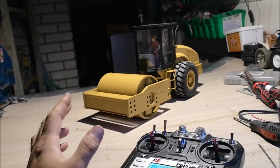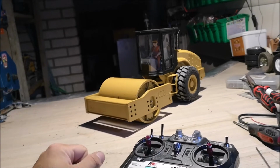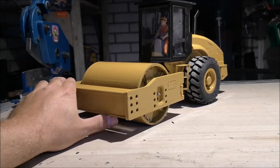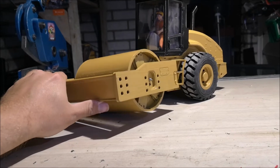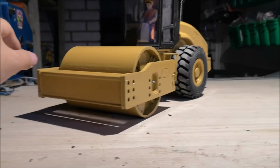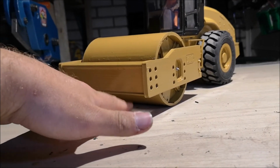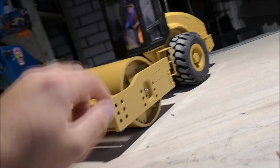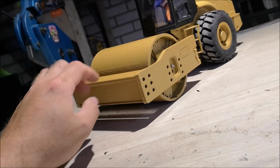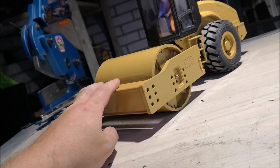The vibration could be a lot stronger actually, but I'll have to check it and see how this thing performs before I make any changes. And also it's got flex. So this is how much it flexes on the front. Yeah, I forgot to mention as well, I need to create the scrapers underneath here. They will be attached to this piece and the piece behind here, and have plates that scrape the drum when it's rolling to keep the dirt off and so on. I'll create them too and show them on the next video.